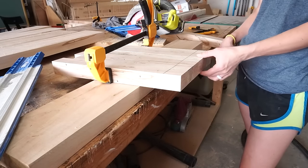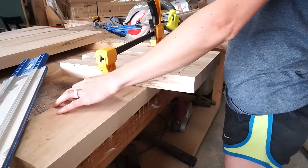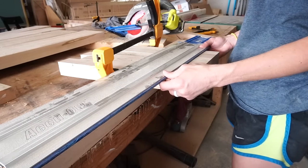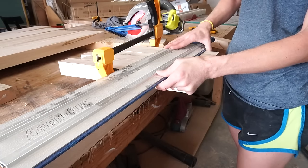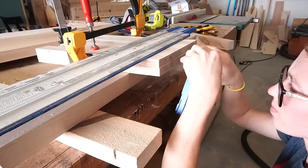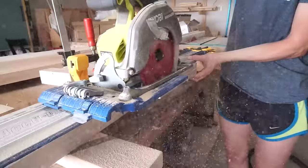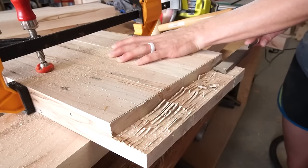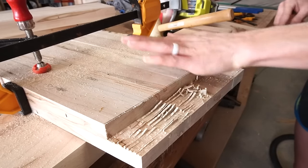You could cut this on a table saw or with a router — if I had a router table that would be really nice. But I decided to use my circular saw to cut all this out. I set my blade depth to cut halfway through the board thickness, made a cut, and double-checked the cutting depth was correct. Then I proceeded to make multiple cuts to remove the material up to the line. I chiseled out some of the rough spots but honestly, this was a complete mess. I should have used the router to begin with. I ended up bringing out the router and set the depth to just remove a tiny bit of material on top to smooth things out.